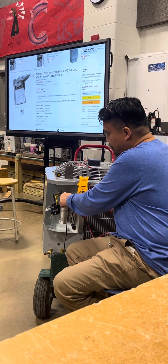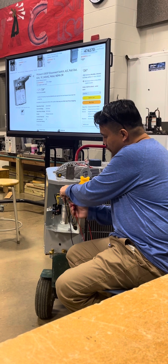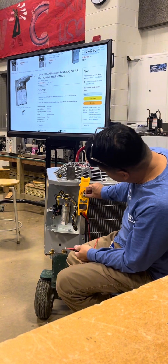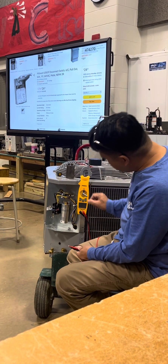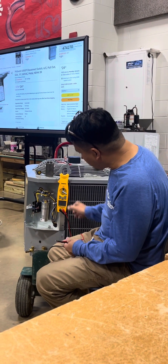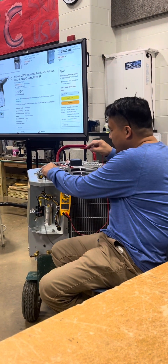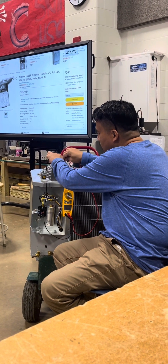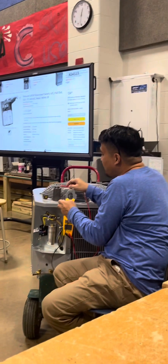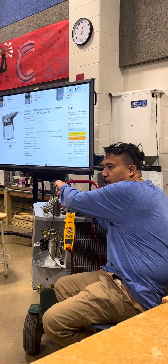Now, if there's a problem with this one — a short circuit or somewhere — if you touch this to the ground right here, you're not supposed to have a reading. You're going to put it to continuity, or what we call ohms. You put it to ohms. You can make the sounds if you like. You hear the sounds? If this one's connected right here, you will hear the sound. This one needs to be separate from this body — making sure there's no continuity.